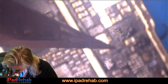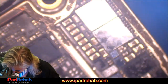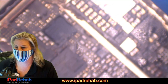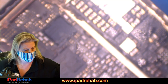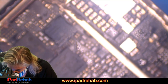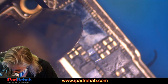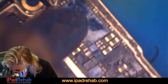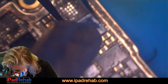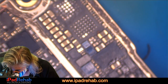All right, what could be getting us into trouble is definitely Tigris over here and these speaker amps as well. Speaker amps have a line. They get power from the main and send it right through to these other little boost lines that can sometimes cause a problem. So let's eliminate those variables of the speaker amp, which can sometimes cause this sort of pre-boot draw. So let's get rid of this one. Grody. And let's get rid of this one. Yeah, let's clean that up.